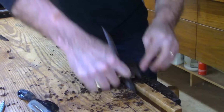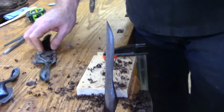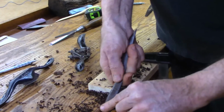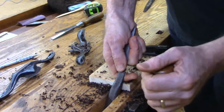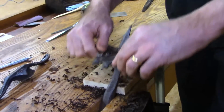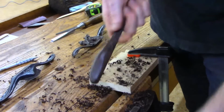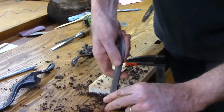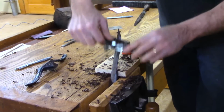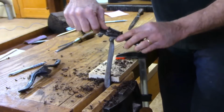So it's really what you want to do. It's almost like there's a lot of things in woodworking. I mean, the simplest example is moving through the progression of sandpaper. You've got a coarse sand on one grit, and then you move to finer and finer. Well, the same can apply to cutting edge tools or even rasps. Rasps have a coarseness, or files. You move to the finer and finer. So I'm doing that with my tool edges. I do the same thing with my block planes. I have a couple different block planes, and you may have seen I keep one set heavier, and then I keep my Lie-Nielsen typically set finer, so I don't have to mess around when I pick them up. I just switch them out depending on the kind of work we're doing.